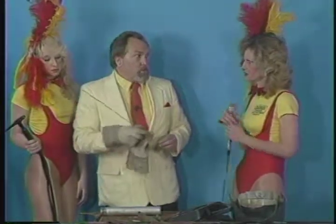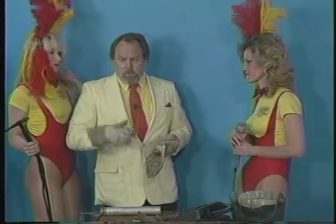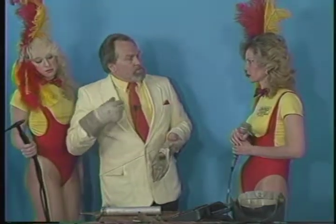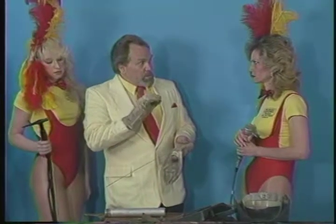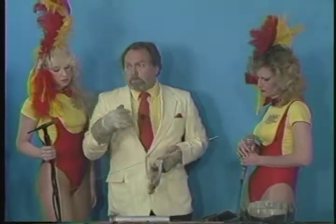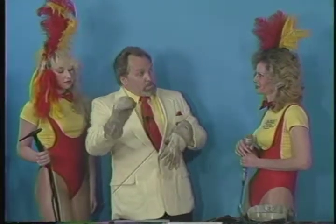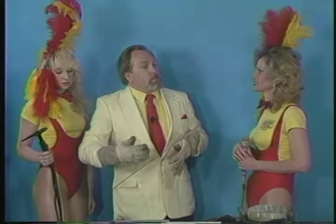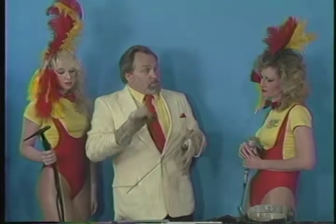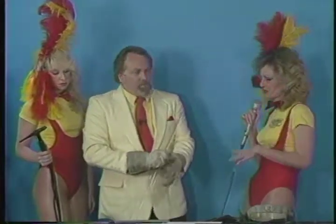Again, a welder does have to know a lot of things. So you have to know these things before you weld. Exactly. Almost all the rod that I buy, except for the rod that I use for gas welding aluminum, is for anodizing. Although there are some people that use the black weld as an attractive thing. I've seen some beautifully done parts with very attractive welds, deliberately done with the rod that wasn't for anodizing, and it looks real sharp having the black weld all the way around. Boy, would that be a surprise if you expected to get your piece back all gold and it's got black all over it.